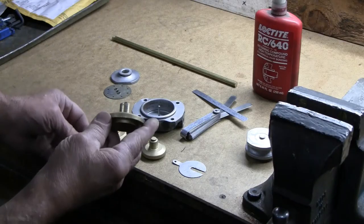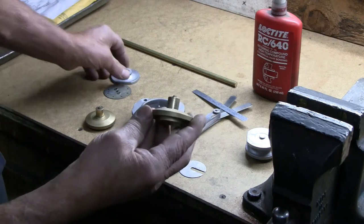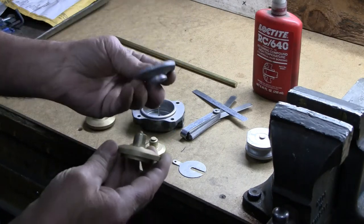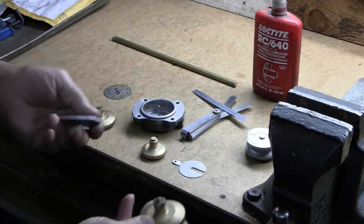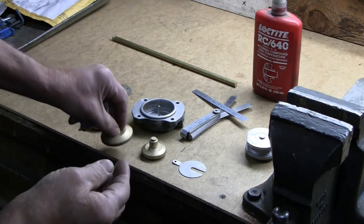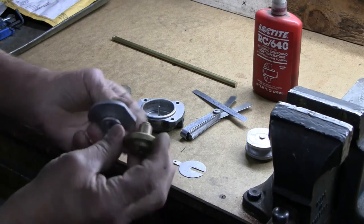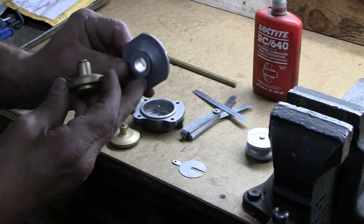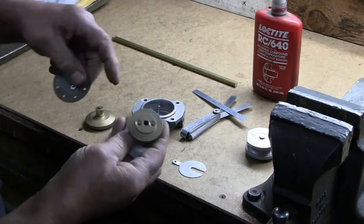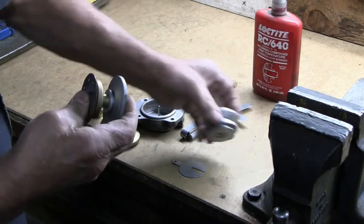The problem with this pair of pistons, and I should probably mention, this is part of the piston. It gets used with a collar like this, and these come in different sizes. These particular ones are 2 1/8 diameter. They also come in a number of other sizes, including 1.5 inches. And this plug here is a press fit into the bore in this collar, and it would go together like that. It gets assembled. The spring goes in here. A couple of little flathead screws hold this on. And the total ends up looking like this.